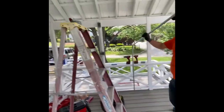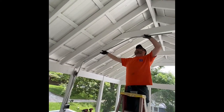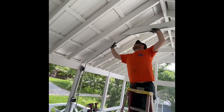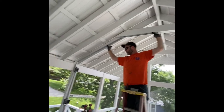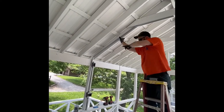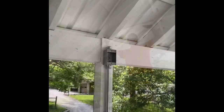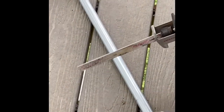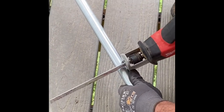That's why you've got to pay attention in geometry class. Now I should theoretically be able to put this flat, right where I want it up against that wall, and it lands just like I want. All I have to do now is measure and mark where I need to cut for my connector, put my box up, and we're good to go. We drew a pencil line where it hits the top of the box, transferred that measurement to the pipe, and now we're going to cut that off with the hacksaw. Your thumb makes a good stabilizer when using a hacksaw.